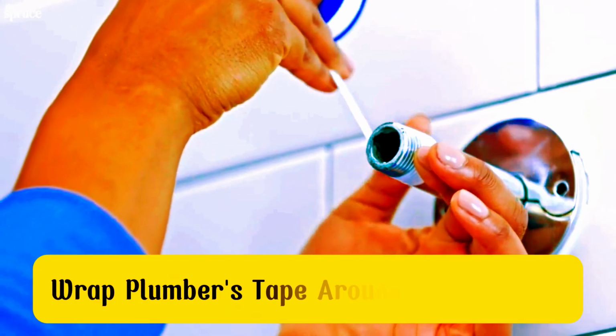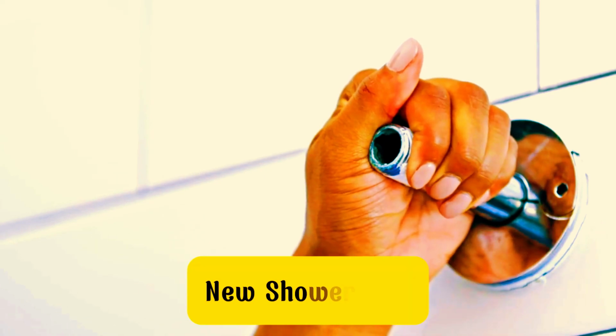Next, wrap plumber's tape around the threads of the shower arm. This helps create a watertight seal and prevents leaks. Wrap it clockwise so that it doesn't unravel when you screw on the new shower head.